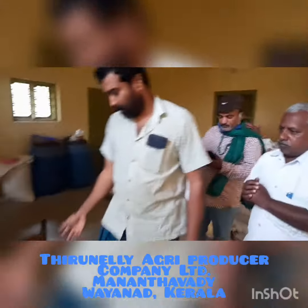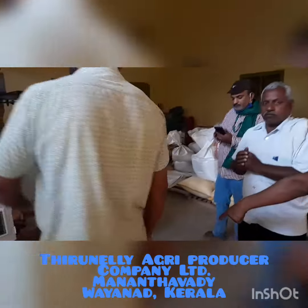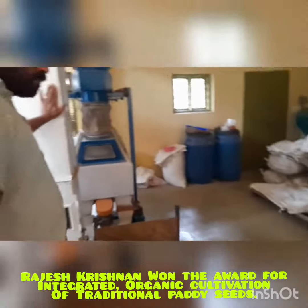Start in here — you put the paddy in the first elevator. The first elevator will take the paddies and put them in this machine. This has a fan, a dusting fan, an aspirator. It sucks out the dust and then the paddy goes into a de-stoner.